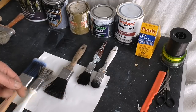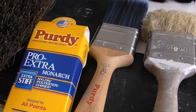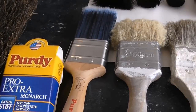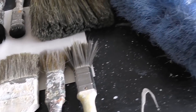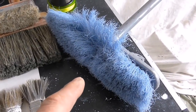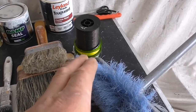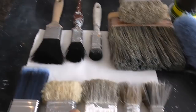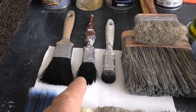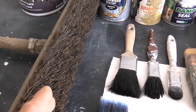Again, it's just turnover - you go through more of them. Applying water based paints, there's nothing new - they've been doing it for hundreds of years using pure bristle brushes. And suddenly you start to see a lot more of this, pushing water based paints, pushing the idea that you have to use something like this. Well, it's not necessary - you can use a brush like this perfectly well and it will last you a lot longer. It doesn't really matter what the synthetic filament is - even sweeping brushes, even fishing line - will all distort. Pure bristle lasts a lot longer, even on a sweeping brush.